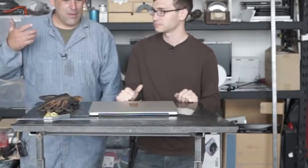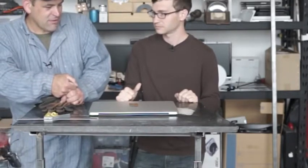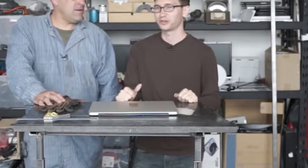I had to work a lot to kind of figure it out. First, I was jamming the gun in too close, and I pulled the gun out about a quarter inch, about a half inch, and that sort of seemed to work, and my welds started to look like welds and not snot welds. It seems like very much a practice makes perfect sort of thing.